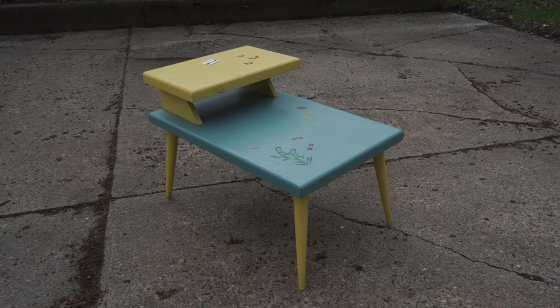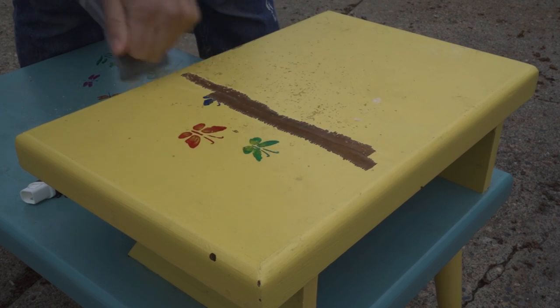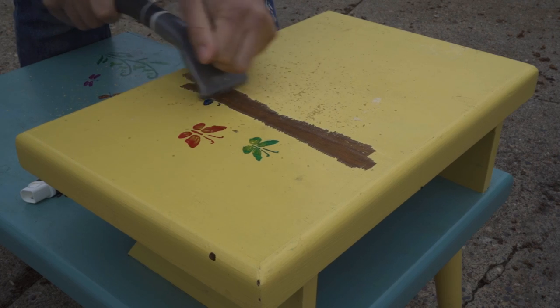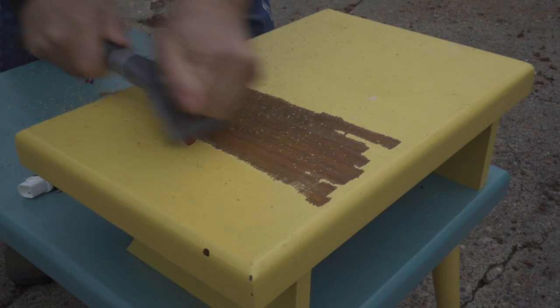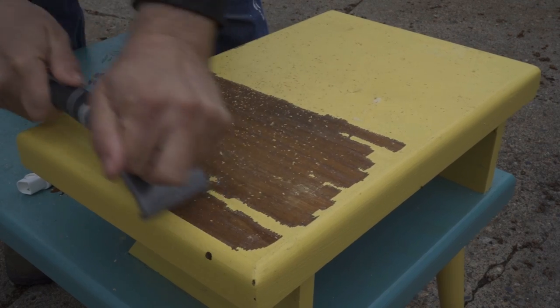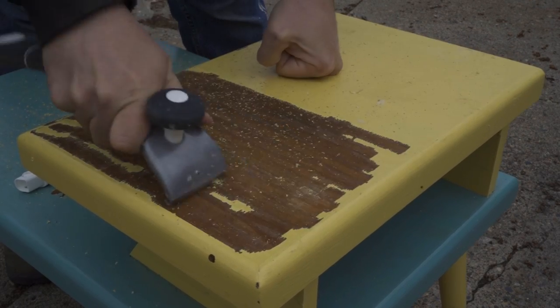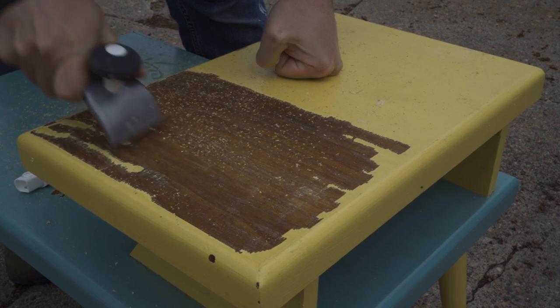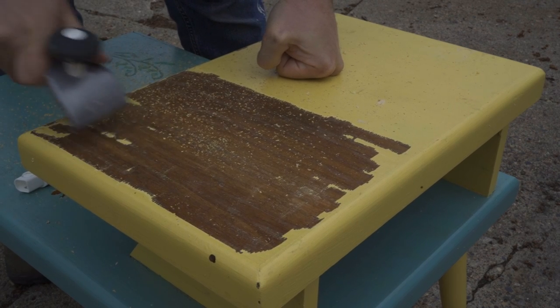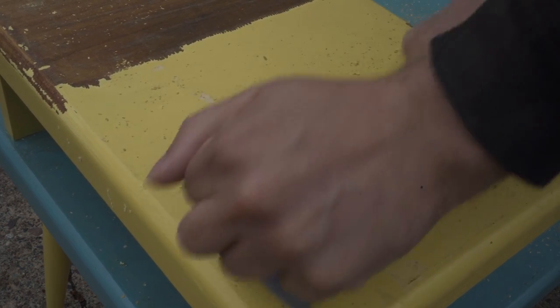The first thing I had to do was take off all of the paint. My finish removal method of choice lately has been scraping, so I grabbed a paint scraper and off it came. Scraping is a lot less messy than taking it off with a stripper — if you can even find a good stripper these days — and it's safer than sanding the finish off, especially when it's a veneer as this one is.